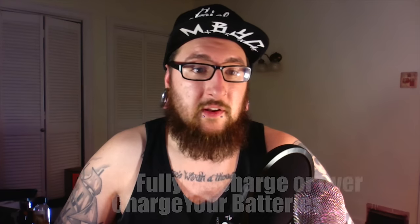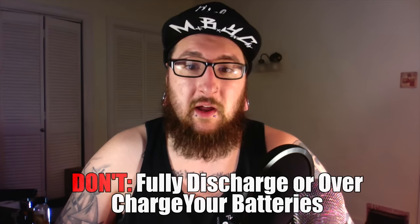First things first: never fully discharge or overcharge your batteries. When charging, keep an eye on them and make sure you take them off the charger when they're fully charged — most of the time that's at 4.2 volts. Most modern chargers have overcharge protection, but that doesn't mean you should just leave them on. Batteries slowly drain even when not in use, so if you leave them on they'll continuously be cycling. Also make sure you take out your batteries before they hit their lowest charge rate — most of the time that's 3.5 volts, and the lowest I'd ever go is 3.2 volts. You'll notice a significant loss of power on a mech mod when batteries are draining; when that happens, swap it for a fully charged cell.